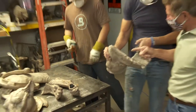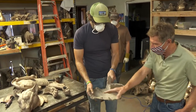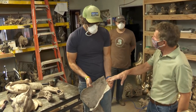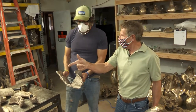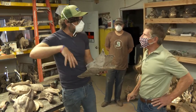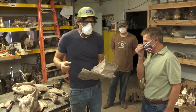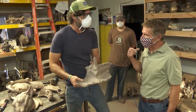You can see how much work it took just to get one of those down. On just this little piece itself, he's got eleven of those — would you call those sprues? Or gates. That you've got to grind down before you even start assembling it like Stan is going to. Normally if we had this all set up, he would have a bench and clamp these down, maybe even have a bigger grinder. It is very time consuming, even that part.